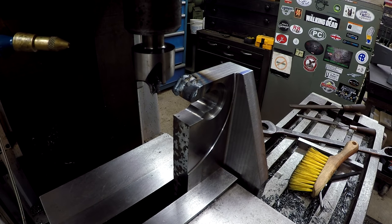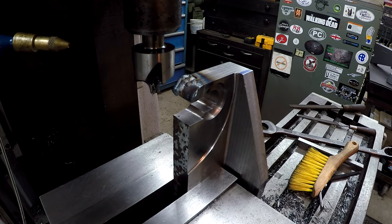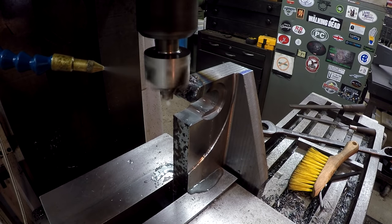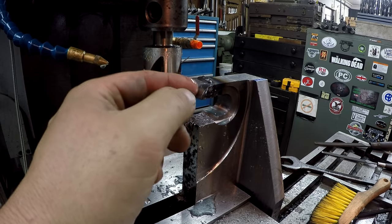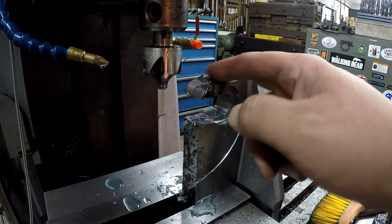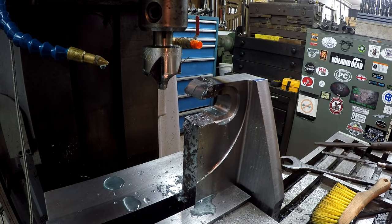Let me see if I can blend it back together with this corner round. I got her lined back up and just kind of touched it and set a zero point, so we'll work back into that. It looks pretty good right there — there's one little spot where it didn't blend too well; I didn't get enough weld there. But it looks a lot better than it did. I'm probably gonna put an end mill in there and just barely skim this top right here to get that bit of weld cleaned off.